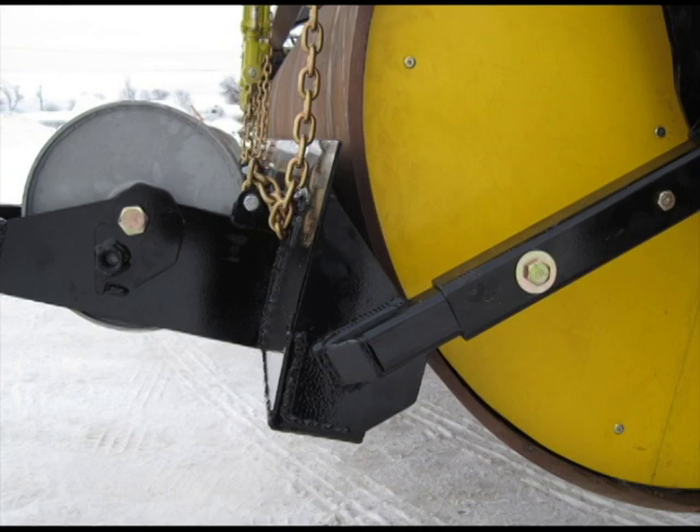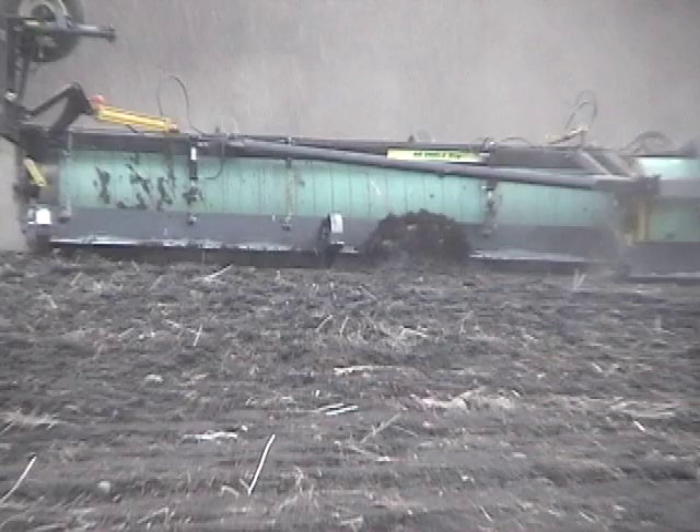The blades have small rollers on 18-inch centers. When pushing dirt, the compression springs in the carrier arm shorten to allow these rollers to ride against the main drum. Using the strength of the large roller means the leveling blade can be light enough to slide up and over large buried rock tips without machine damage.